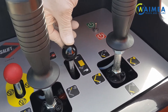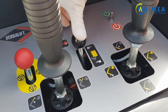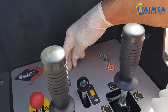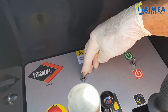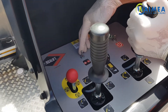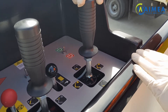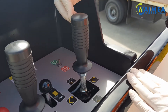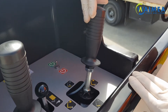We have a bucket tilt lever here. This needs to be pushed over and held in position while also activating either one of the dead men. This switch is for the emergency motor — it will need to be switched on and the function operated with the dead man and whichever function you need. This joystick controls: straight up is lower boom raise, down is lower boom lower, to the left is clockwise rotation, and to the right is counterclockwise rotation.